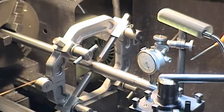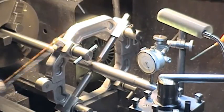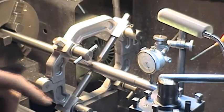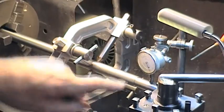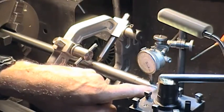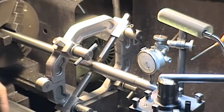This is a slight experiment. We've moved the steady up and locked it onto the bed. To make life a little bit more difficult I've taken the tailstock back and taken the live center out. What I'm going to try and do is generate enough truth at this end to be able to do the final bit of machining, which we'll imagine is important.